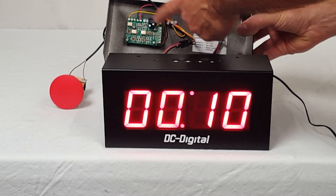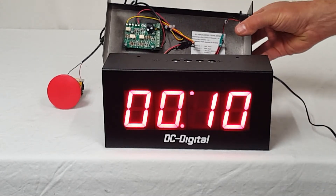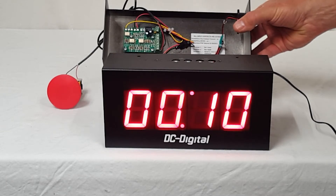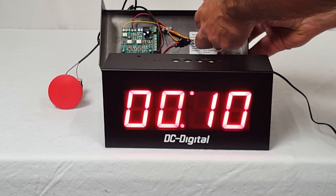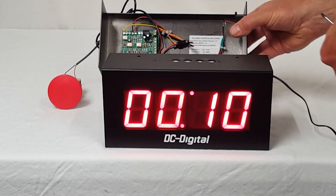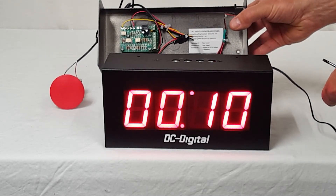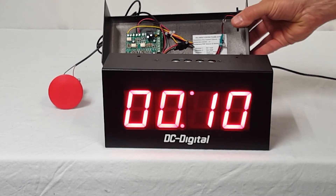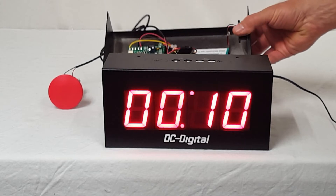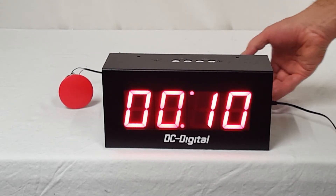To run their cabling, there are three knockouts — they're half-inch conduit, three-quarter-inch hole. You can run your cabling up through it, and to mount it, there are knockouts for a two-by-four or a four-by-four electrical box. You can see the buzzer here, and power is 120 volts AC wall adapter with a six-foot cord.